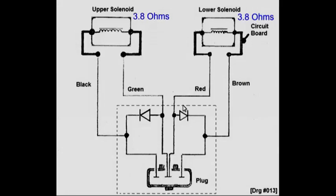This patched area represents all the components inside the plug. The flyback diode, through reverse engineering, I identified as a BYW32. What I did when I repaired mine is I put two diodes in — a pair of diodes — so it had double the protection. The reason for the flyback diodes is to protect the engine management system from a reverse pulse, which would otherwise come down and go around the circuit.